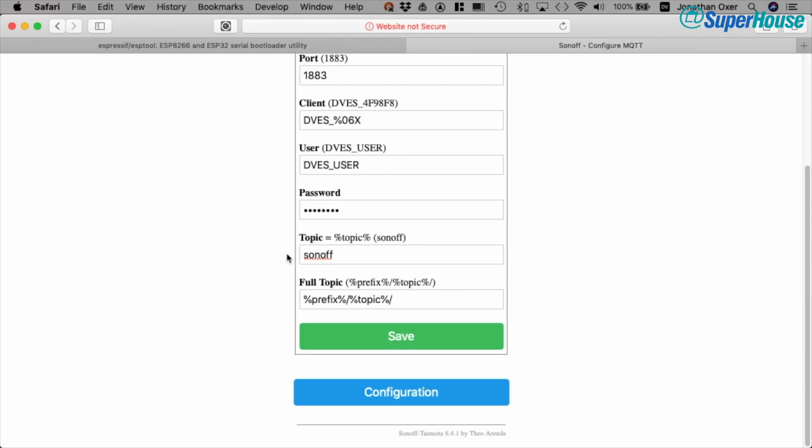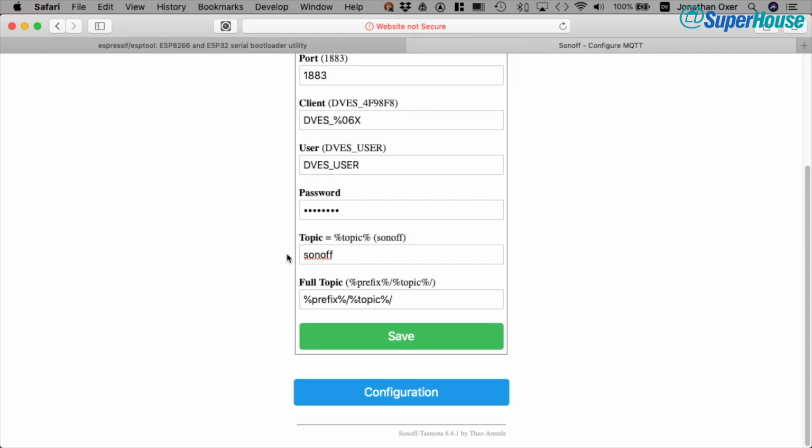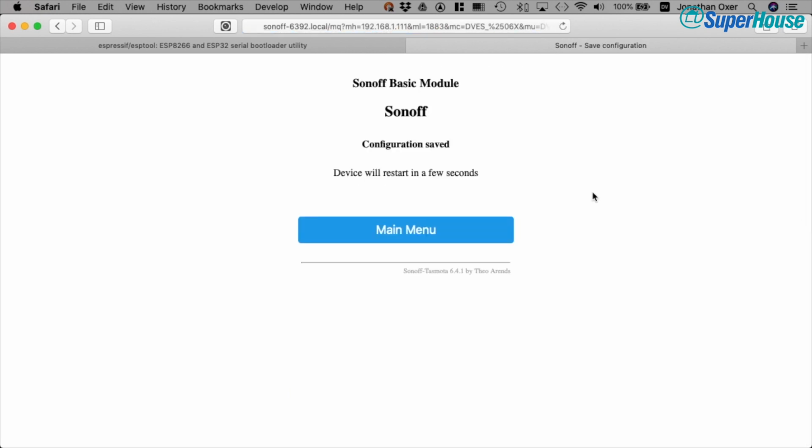But my preference these days is to customize things as little as possible. So what I do is leave that topic untouched. I just leave it as Sonoff. Now yes, what that means is that I'm going to have multiple Sonoffs all subscribed to the same topic, and if I send a command to say cmnd/sonoff/power on, then all the Sonoffs will turn on. But in reality what I do is I totally ignore that topic, and instead I use a fallback topic. And that means that I don't have to mess around with configuration or remembering what the particular things are on each Sonoff. So I'm just going to hit save on this. This may all sound very confusing right now. Hopefully it'll make sense very soon.